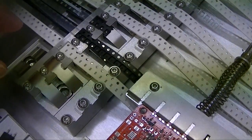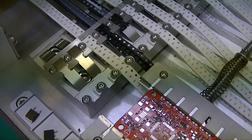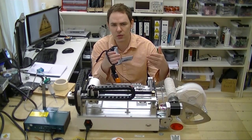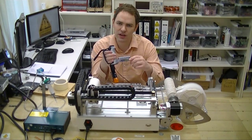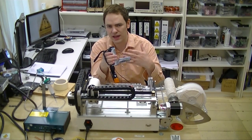And then here, a small strip of 3.3 volt voltage regulators — we use these in just about every project. And then finally, these are the ferrite beads that are often used to filter a USB power supply on a board. Those are most of our main parts — that's what I end up pulling out over and over when I'm stuffing a new board. So having the machine take care of that, and then tossing a few chips on myself, it's going to save me hours of hand placement, especially when you consider the advantages of using a reflow oven over soldering something by hand.